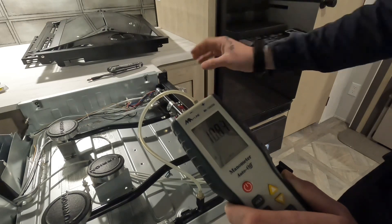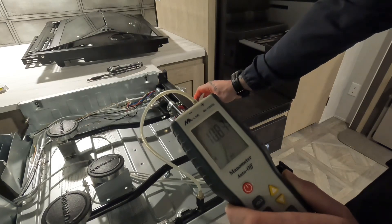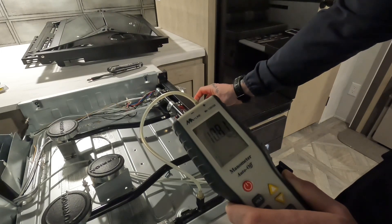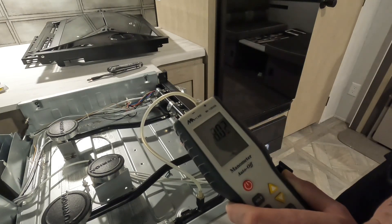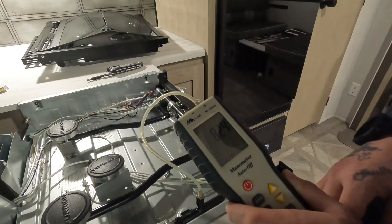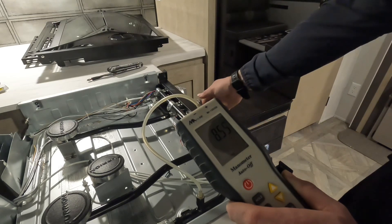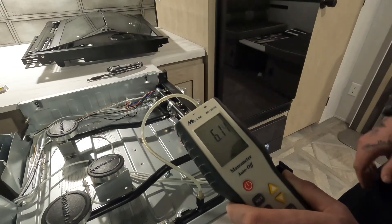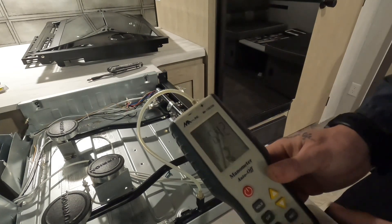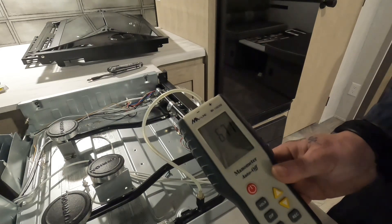That's pretty much where you want your test — it doesn't need to be exact, but 8 inches of water column is the target. You're going to notice it takes a little while; it kind of sits there bleeding off that pressure, and then it's going to start dropping drastically after that. I went a little below 8, which is fine — we're going to have some more LP expand in the lines. Propane does expand, especially with temperature changes, so we'll try to get it as close to 8 as possible. I went all the way down to 6, but as you can see, we're going to climb right back up to near 7 or 8.